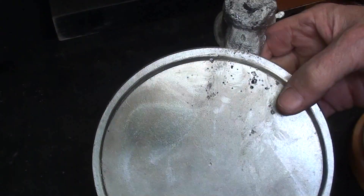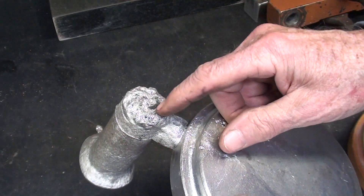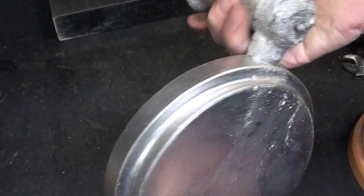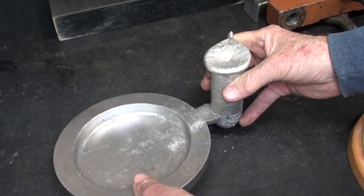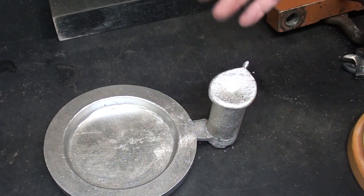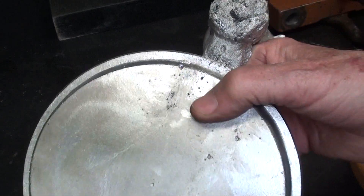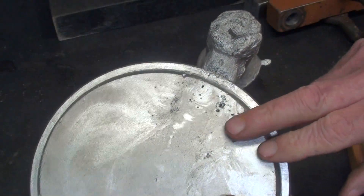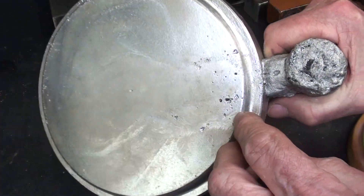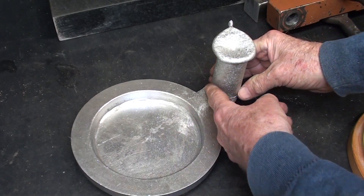However, on this side I had a bit of fall-in — sand got washed in, probably from this area here at the bottom of the sprue. I'm just short-cutting because my flask isn't big enough, but if I had a runner and a trap, it would have caught that. Rather than scrap the casting, I'll just clean that up, and just a little bit of bondo in there. It's going to be painted anyway, but I'm not real proud of that little area there. Let me get this cut off.